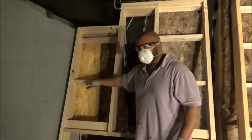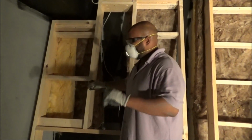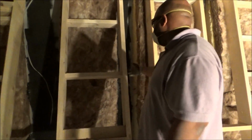This will all be drywall with one layer of 5/8 drywall, a layer of 5/8 MDF, and then another layer of 5/8 drywall. That'll all be here. That's why this inset is here, so they can sit on this. So, yeah, you'll have that flat plane of audio. It'll fall out, and then this insulation will catch whatever gets back here.